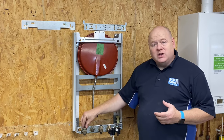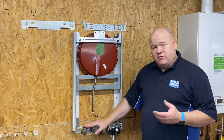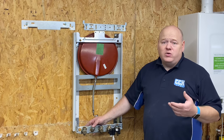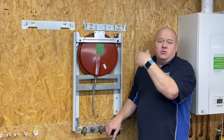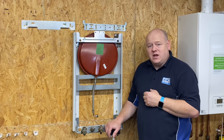It might be a good idea to put some new washers on — some new fibre washers on your flow, your hot, your gas, your cold, and your return when you put it back together. Also for the flue, maybe put a bit of lube on it just so that you don't damage the flue when you put it back together.